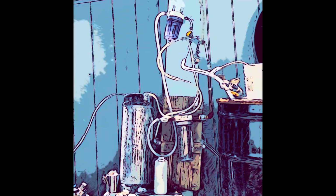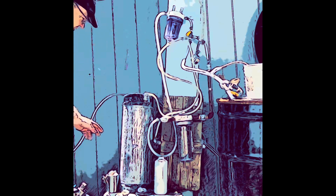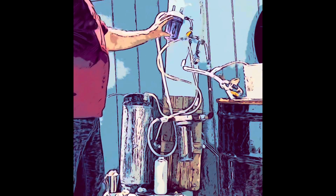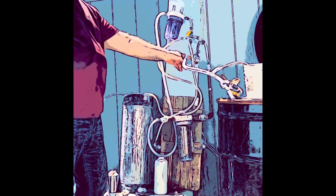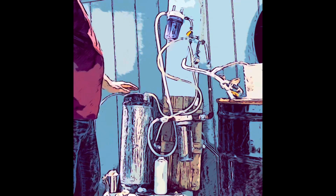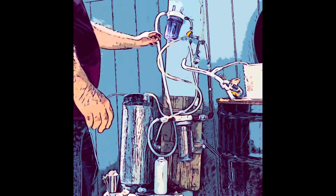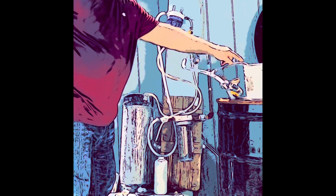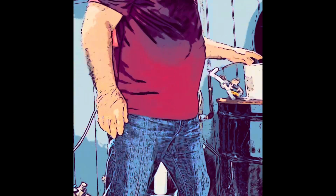So over here I have the CO2 container. I'll open the valve on this, pressurizing this. The valve here is closed, so all of this system should be tested for its ability to maintain pressure. I've got a meter right here to read the pressure, and hopefully this will seal off. Once that happens, I will crack this valve, and it will come to this point where it will bubble into the water, soapy water here, making bubbles.